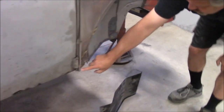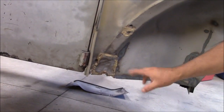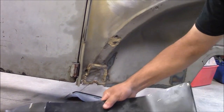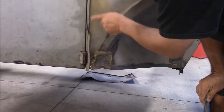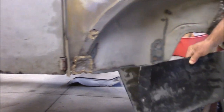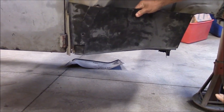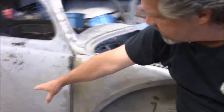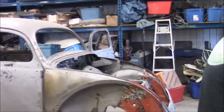section, now that we have this crucial point here with that new hinge section welded in place in the accurate location, this is now going to be the next section that's going to be removed, and we have the replacement panel once again, and good quality replacement. So that tucks in behind, and then this new strip gets folded over just like the factory, but then this will be cut out next because we have a lot of corrosion there. So we'll end up removing this, and then we'll have our new replacement piece that will go into that section. And then once we have that fitted in place and the back section, that's when we can refit the heater channel back in.